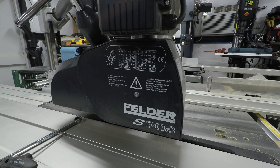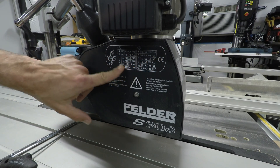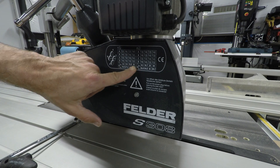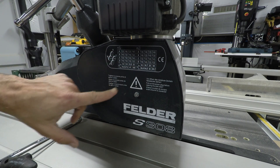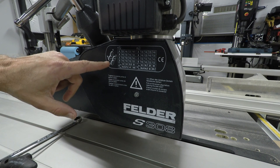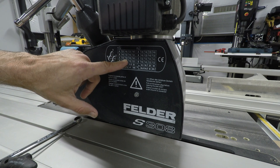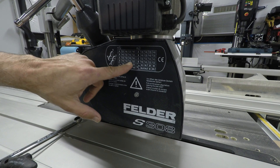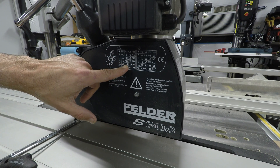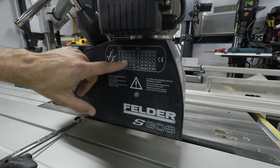When I first got this machine, I went ahead and marked the gears. On the side of the feeder it has all these different ratios you can set up for the gearing — how many feet per minute in position 1 and position 2. The diagram on the side shows you position A, B, C, and D. Basically, these numbers are how many teeth are on the gears. So if you want 8.3 for setting 1, you need to put the gears in these following spots.